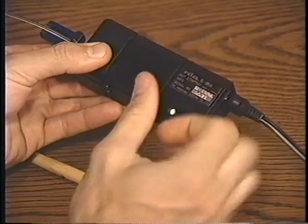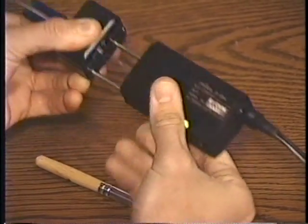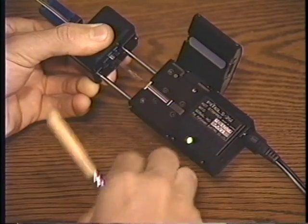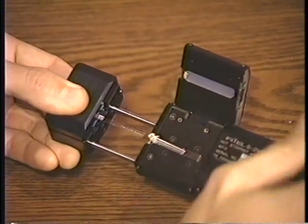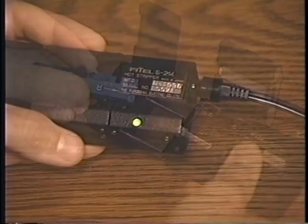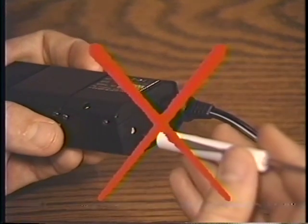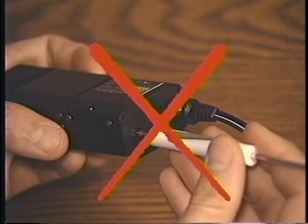During normal use, the heated stripper should remove the coating in one pass so that the matrix comes off in one piece. If the matrix crumbles or you're breaking fibers, proceed through this checklist. Do not attempt to adjust the temperature of the stripper. This generally leads to more problems rather than fixes.